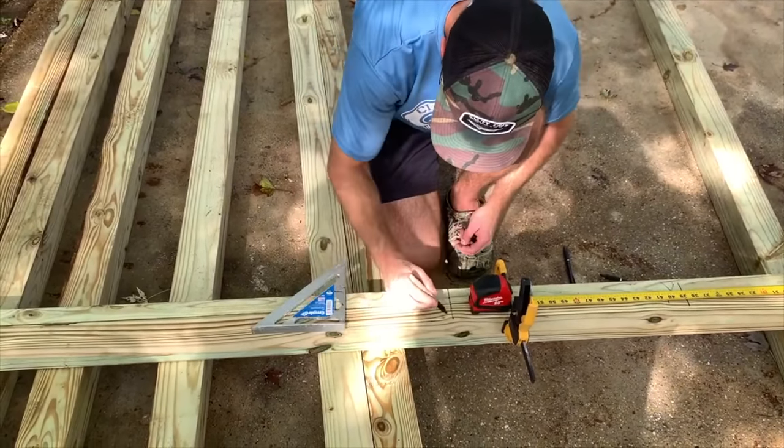So after removing all of the protective foam from the curtain, grab the end of the curtain and pull it down into the guide track. Do this slowly, make sure that you're within the guides on both sides of the door's rough opening, and then simply thread the curtain down through the guides until you get to the bottom.